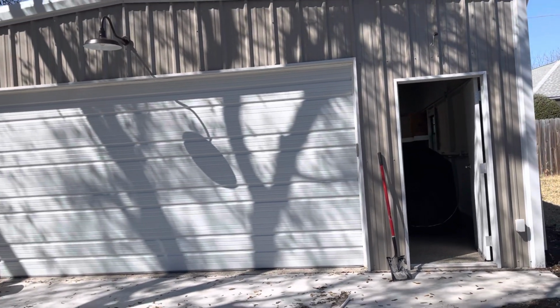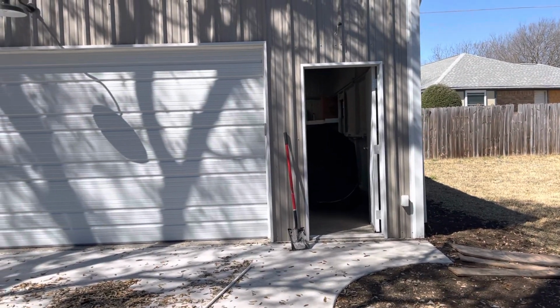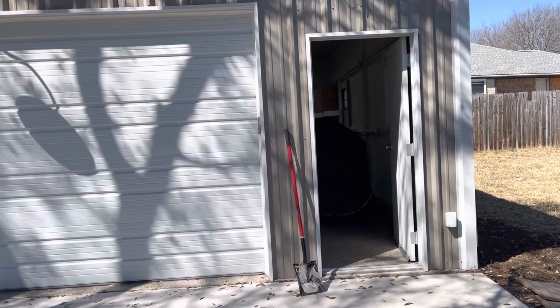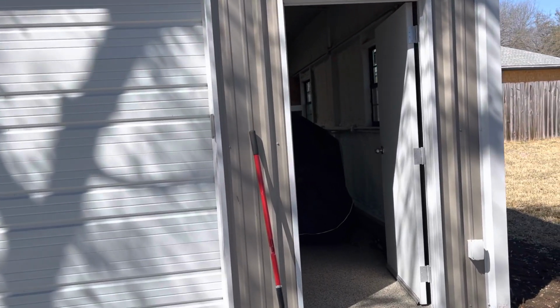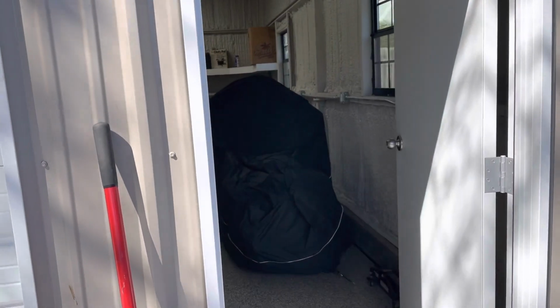This is going to be just electrical, all things electrical about this shop right here. First of all, this shop is run off a 100 amp sub panel. Some people run off 60 or 40 amps, but I want it to be kind of overkill. You never know what someone's going to want to plug in here. I also wanted to run a welder in here.